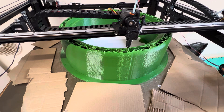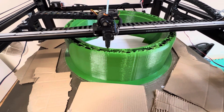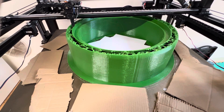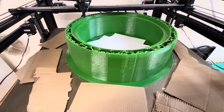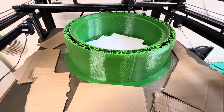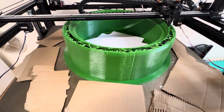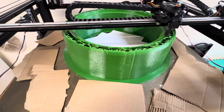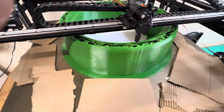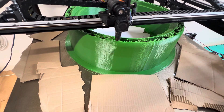The volumetric capacity is still pretty insane — I'm running at 65 cubic millimeters per second. The fact that I can punch out a 2kg part in effectively about 17 hours is really exciting for me as a production machine. I don't need a high-speed gantry, and the customer is quite happy with the Z layer lines, which are a little accentuated from the angle I'm standing at, partly because PETG is just so shiny.